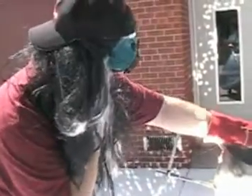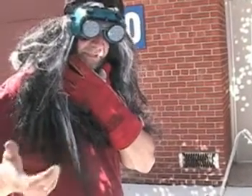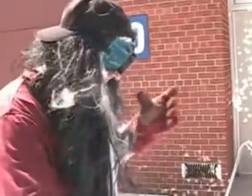Okay guys — it's only been about five minutes. If you look carefully here, this water is already boiling. This black kettle is actually proving to be much more effective at heating this water. So it's been about six minutes and this water is actually boiling violently. We've reached our boiling temperature. We're going to run some calculations, because we know we put 500 milliliters of water in here, we know the specific heat of water, we know how much time it took — so we'll compute the joules per second that went into this pot and get some kind of output rating on this disc. It's not really efficient because we're losing a lot of energy, but we proved our point — we were able to boil water very successfully.